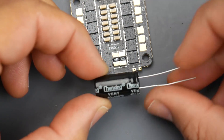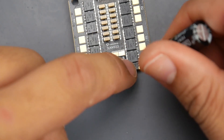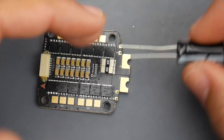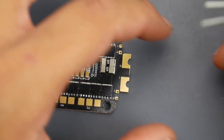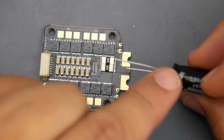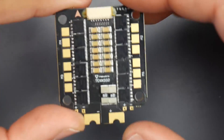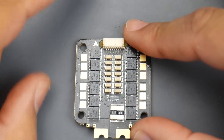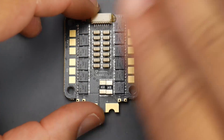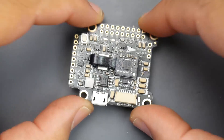This ESC comes with a 1000 microfarad low ESR capacitor - a good Chinese brand I've tested and it performed very well in noise testing. However it won't fit in the designated holes, so you'll need to mount it on the main battery rails. Install it with the negative side to the minus rail and the positive side to the plus rail, and just bend it over. When installing in your quadcopter, make sure you follow the arrow indicating the front - this is very important because the motors are labeled one, two, three, four in default Betaflight orientation, or it'll never fly correctly.